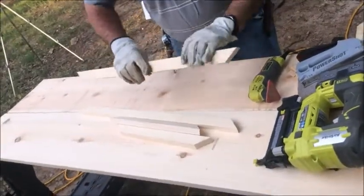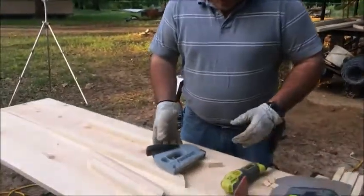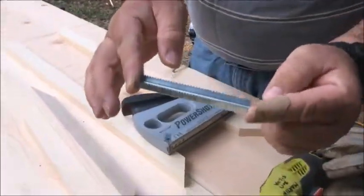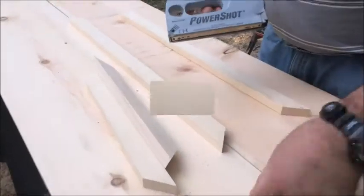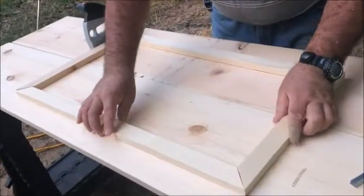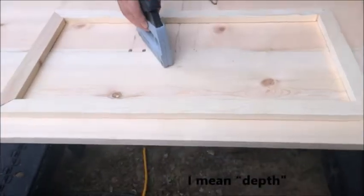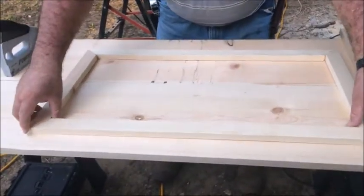Smooth the edges. Now let's put together this with a stapler — a heavy duty stapler. This is a 3/8 heavy duty stapler, and this is the machine. It's about $20 for the machine and about $5 for the staples. Let's see how we put together a frame 3/4 inch deep with a heavy duty stapler and a center bar. Let's put together first the frame itself.